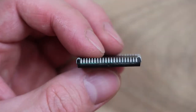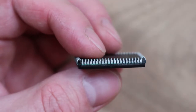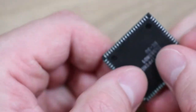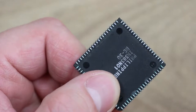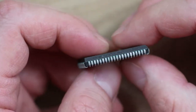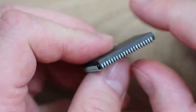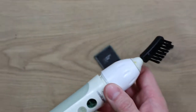What I've done with this chip is had a go at cleaning it up. I think it's this side here — these contacts that I've had a bit of a go at should look a little cleaner. It's not too bad, but you can clearly see there's a lot of corrosion on here from the battery and where it's been sat in the socket. What I've done to clean it is come up with this half-falling-to-pieces gadget — it's just basically an ordinary electric toothbrush.